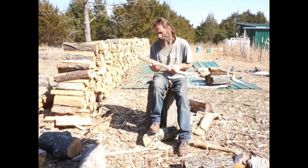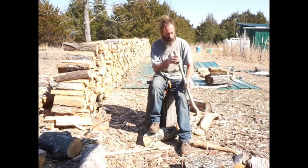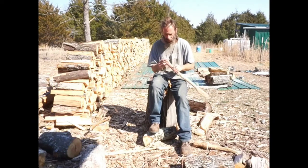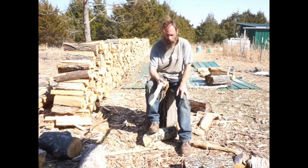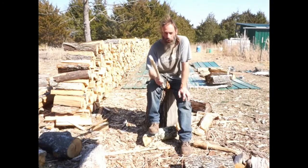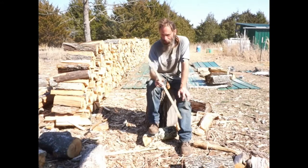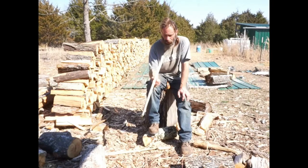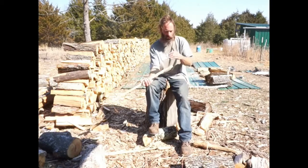And at this point, if you're seeing cracks, you might start wondering something about oak. This blank is actually carved with the grain like you would expect a normal hickory handle. There is one downside to this with oak, and that is that oak, from what I've seen, tends to split along medullary rays. With a dried piece, probably worse than it actually splits along the grain. So it might actually serve you better to get a dimensionally stable piece of oak if you're going to use oak with the grains running this way.